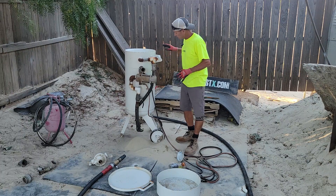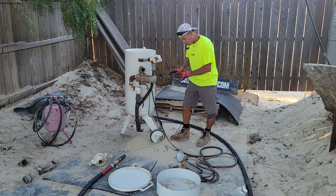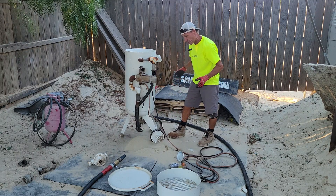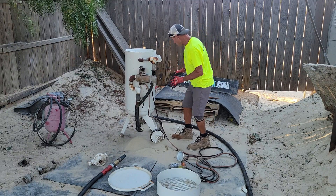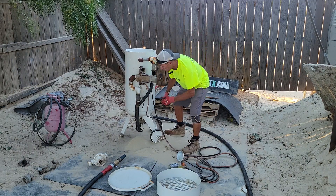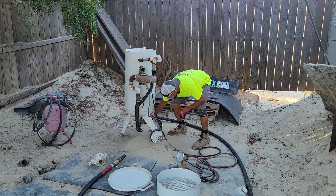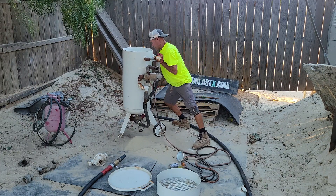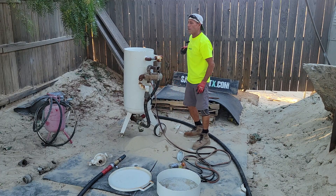Put your sand in — don't fill it all the way up. Turn this thing on, put a little bit in, get some air flowing through here, make sure everything is clear, and start turning up your valve until you start getting some sand coming through. Once you got it running pretty clean, you need to adjust your sand. This is your adjustment down here — you might have a red knob. Open it up, more sand comes out; close it up, less sand.